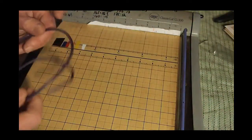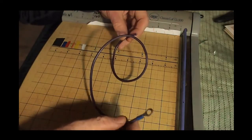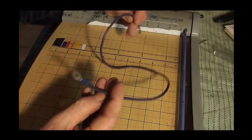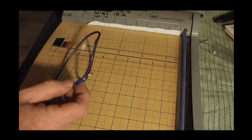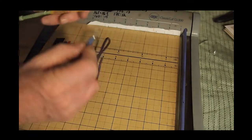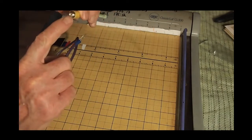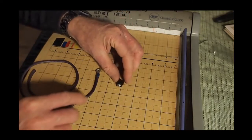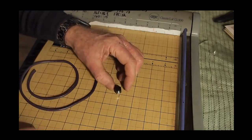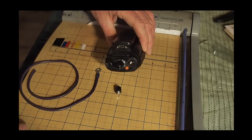You don't have to spend much to create your own counterpoise or rat tail. Something like this can be made for under a dollar, and this would connect onto your antenna base and go between, as long as you are making a connection to the grounded part. You will notice that on certain antennas, like an MX connector, you have no access to a ground the way they work. Indeed, with this Motorola, that would become difficult.